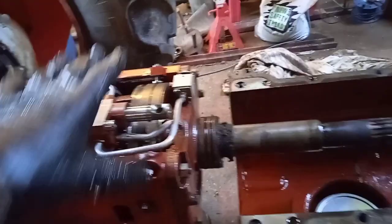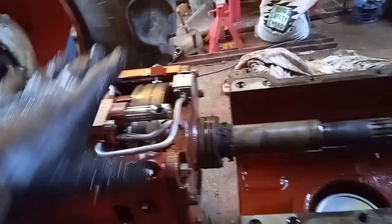The back of the gearbox is now hanging off the back axle, and the front I've taken the engine hoist off and just sat it on an axle stand for now, so I can bring the engine hoist round to take it away. It all went pretty straightforwardly. I needed just a little bit more weight on the trolley jack and the two jacks — it was a little bit low so it dropped and went tight, but it wasn't far out so not much adjustment was needed.